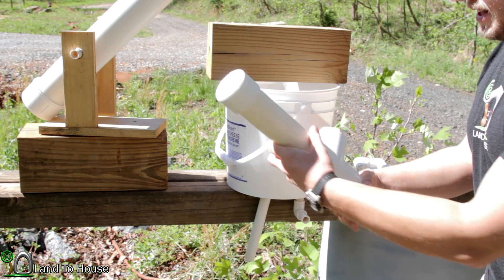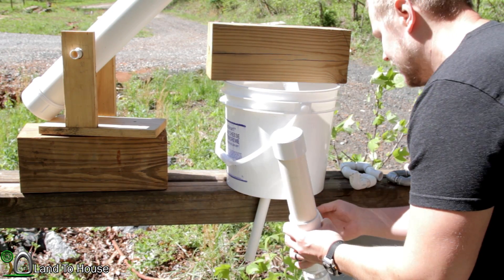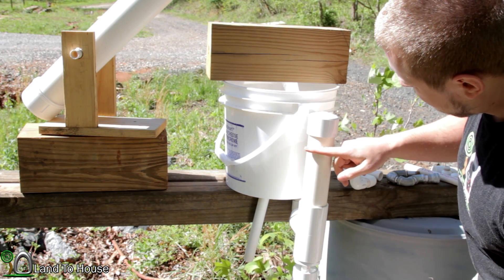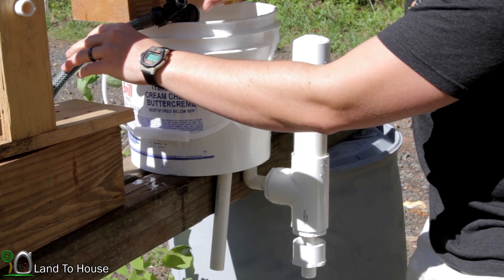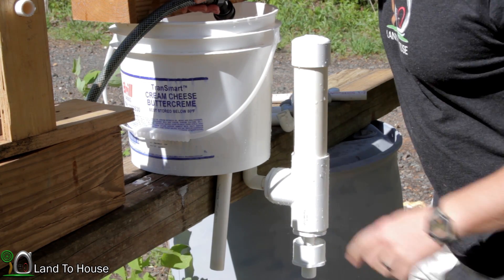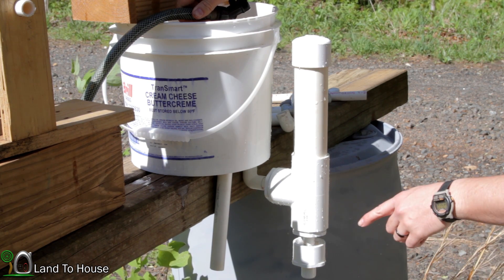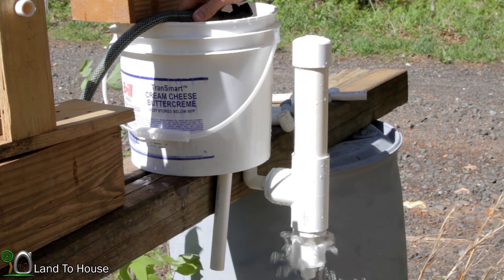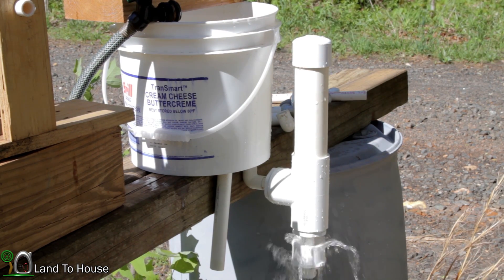Back out to the water testing ground. Because this thing is heavier than the U-Siphon, I have got a block of wood here to counterbalance the bucket. I'm going to stick this onto the pipe. Our standpipe is going to be somewhere right in here, which means the water has to reach that height in the bucket before it will pull this over. The first test is going to be with the high flow, low storage tanks. I'm going to open that up — should fill this pretty quick. The water is right here. Okay, it's pouring out now. There's some bubbles. It just pulled. That was nice — definitely pulled quick with that high flow rate.